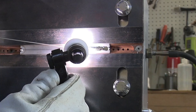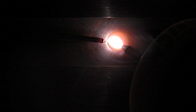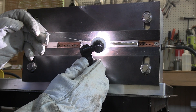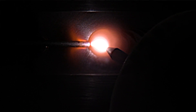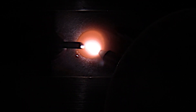If you slip the rod in against the base metal it'll stick every time and give you fits. One thing that helps a lot on a 2G test like this is pointing that electrode upward a little bit and having a little extra argon flow to compensate for argon being heavy. A large cup like this serves a couple of purposes: it provides the necessary gas coverage on titanium where there are color and discoloration requirements, and it gives you leeway on how far the tip of the rod can come out of the arc. You don't want to oxidize the tip of that rod — it's especially important on titanium — so if the rod flips around a bit you'll still be in the argon envelope.